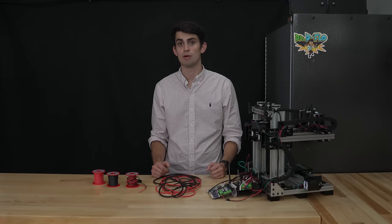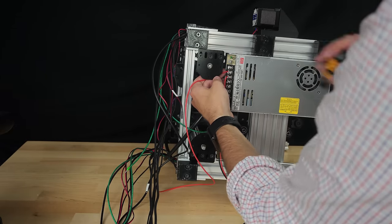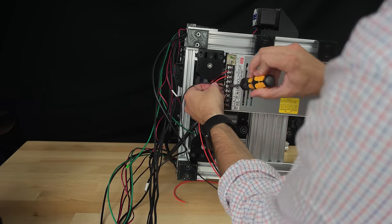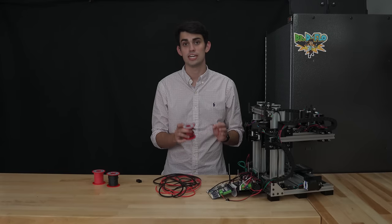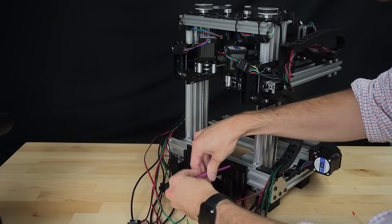I find it easier to only buy wire where the maximum current load is listed in the product description. The wires I am using for Zydex are capable of carrying 8 amps of current. Yes, this is lower than 12.5 amps, but I'm using two pairs of these wires because the expansion board has its own power input. I should also mention that these wires have insulation that is rated for relatively high temperature applications, which is a good specification for any wires used when building a 3D printer.